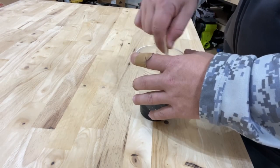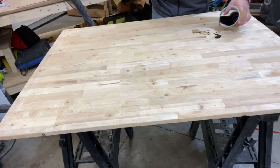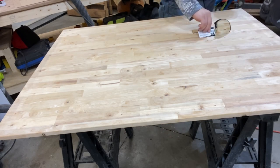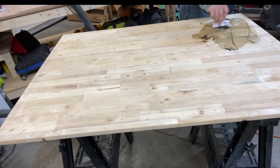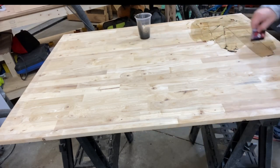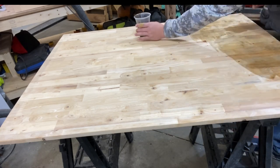When using Rubio, you don't need to use the accelerator, but it helps cut down the curing time from about 3 weeks to one. I should have used smaller syringes here, but I was out, so I used these large ones instead. When you're mixing the oil and accelerator, make sure to mix 3 parts of oil to 1 part accelerator. Once you've mixed your Rubio and accelerator together for about 3 minutes, you can start to work it into